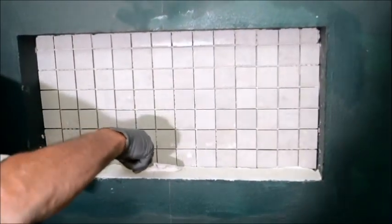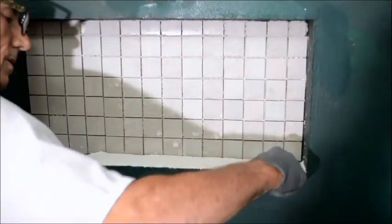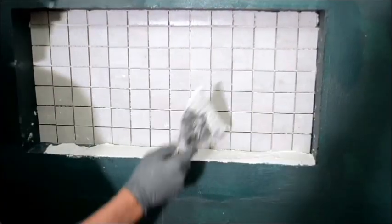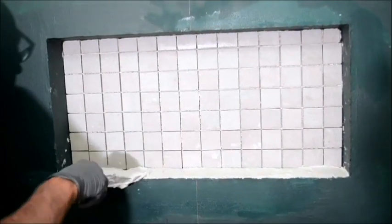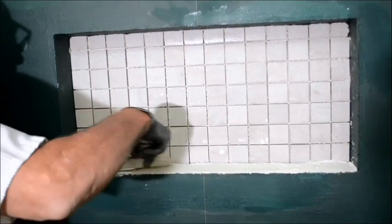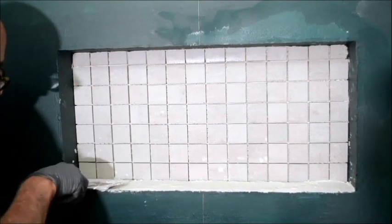And this is basically just doing the inside and out, as you saw earlier, how I made all these lines line up the best they could. Sometimes when you buy this mosaic on a mat, the mat itself, or the tile on it, is not lined up properly, so you've got to pull out those individual pieces sometimes and do it appropriately.